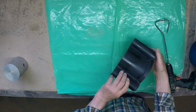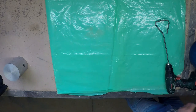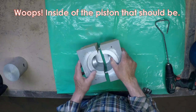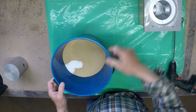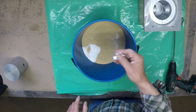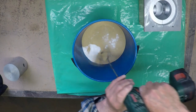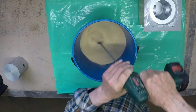This is the rather ugly pattern for the thing - very ugly pattern indeed. What we're actually going to make today are the cores that produce the inside of the pattern. We're going to make them in a CO2 silicate sand, and here we have 5 kilos of sand and half a percent of glucose powder - the white stuff. Just the sand and the glucose powder first.